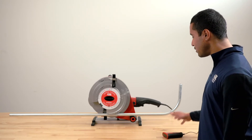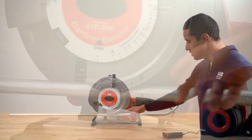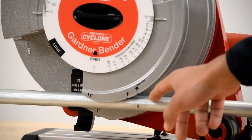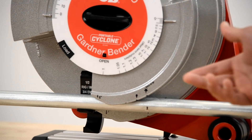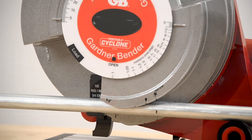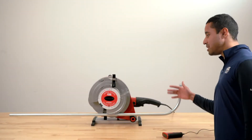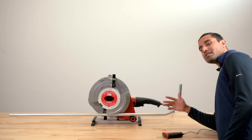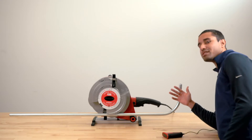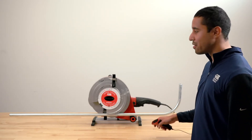For this example we're doing 20 inches between each bend, so measure 20 inches from the end of the conduit to the mark and line that mark up with the back-of-90 star on the bender. When you do this bend, you should get 20 inches from one bend to the other. Keep in mind you want the conduit to be in a single plane so that when the back-to-back bend is done, everything is lined up straight.